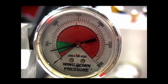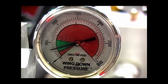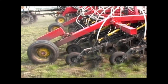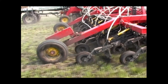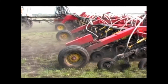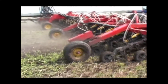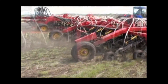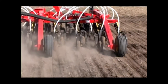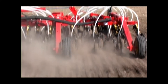The directional valve wing down pressure block is set from the factory at 200 PSI, which should be sufficient for the majority of seeding conditions. If you find that the rear carrying wheels on the 3310 wing frame are occasionally floating above the ground, then there is not enough frame weight transfer to the inner wings. If the rear wheels are lifting off when on level ground, seed placement will be compromised. This may occur in particularly dry seeding conditions when running with the PHD opener system pressure in excess of 1200 PSI.